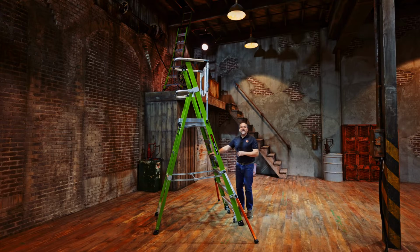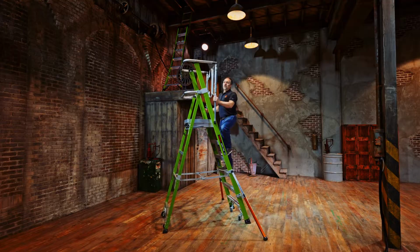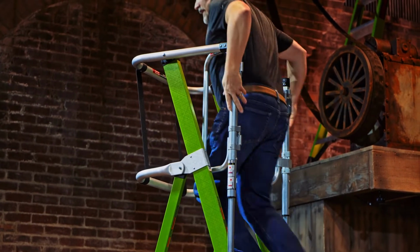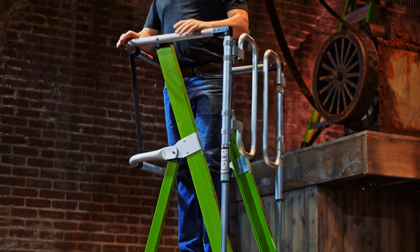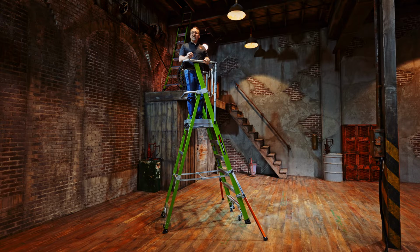As we step up into the Safety Cage, you'll notice that there are one-way gates. As we step up into this cage system, now it meets all definitions of scaffolding or a scissor lift with a 42-inch guardrail, mid-span, and a toe kick. It meets all of the definitions so that we no longer require tie-off from above.